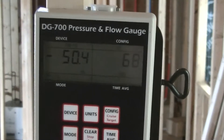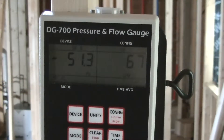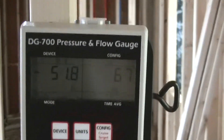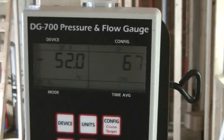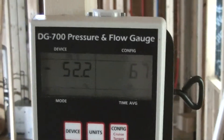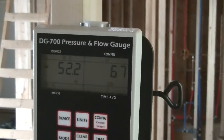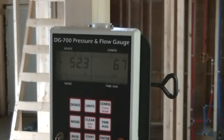There we go. So as you can see, pretty darn good. I took the baseline before I made the video — it was negative 0.3 — so we're already over that. I'm definitely getting below 70 CFM air infiltration. I've never heard of numbers that low before. So this is a pretty darn tight house, and I'm proud of it.